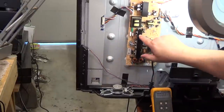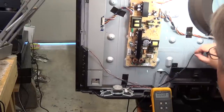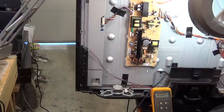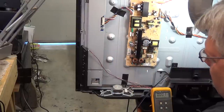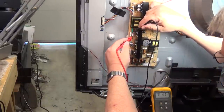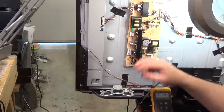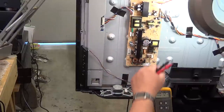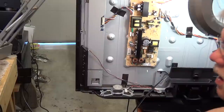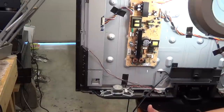It's probably blown because these transistors have failed. So let's get this thing unpowered again. We'll discharge that capacitor and pull the board out and just measure some of these transistors. I bet we're going to find that the chopper transistors have failed and it's taken out this fusible resistor. Measuring across the resistor, you'll see there's a high voltage — 348 volts still dropping — because this fusible resistor has gone open. We have a short. Let the capacitor discharge and then we'll take a look.